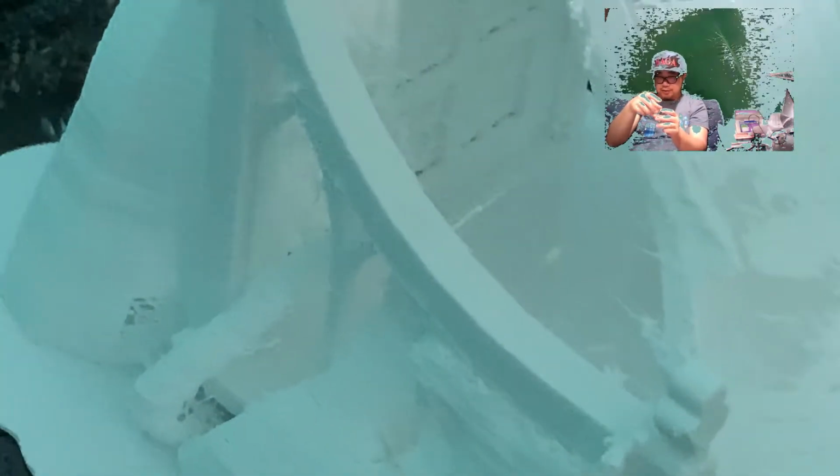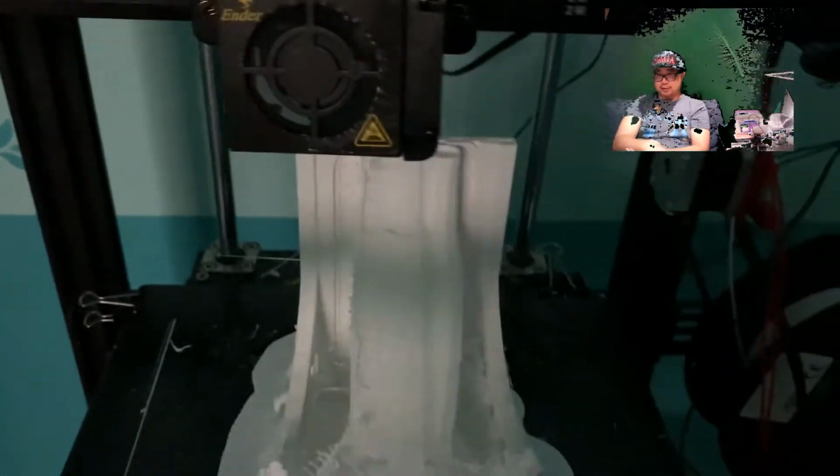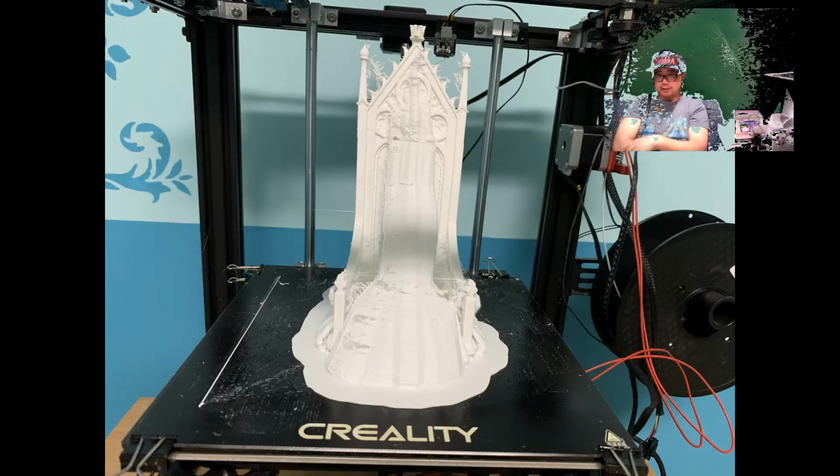Now, why I say it's controversial is because I have to undo the top screw, right, to take the Bowden tube out so I can put the cleaning tool in. So every time I pop the Bowden tube out of that locking mechanism, I weaken the lock, right? Well, that's the trade-off. So I recommend doing it once in a while, but not too often.